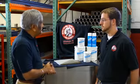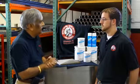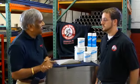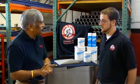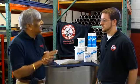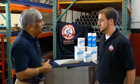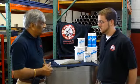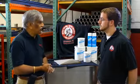The main important feature of this product is that since it's aluminum-based, when aluminum goes into the weld metal it acts as a scavenger because it has more affinity for oxides and oxygen. It will combine with oxygen and oxides and come into the slag, thus creating an X-ray quality weld. Also, while welding on top of it, it will not leave any inclusion or create any porosity in the weld, so you will get X-ray quality weld.